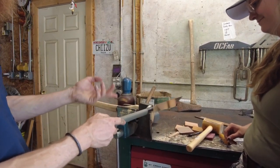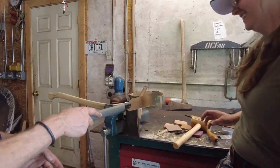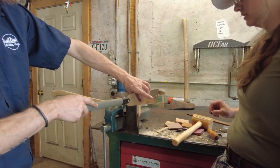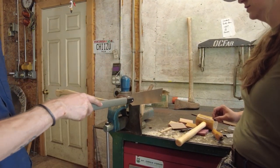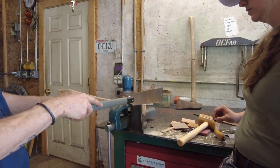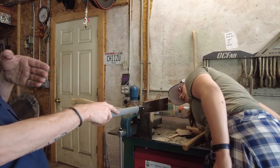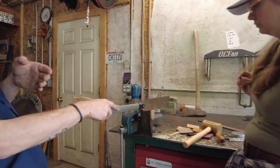Ooh, I just broke it off, which is actually gonna benefit us in this. Yeah, that'll be fine. Because this saw is, like I said, designed to track however you get your first quarter inch in. That's how it's gonna track. So you can keep that saw straight up and down, and you can stand back and see it like this and line it up and get it going again.